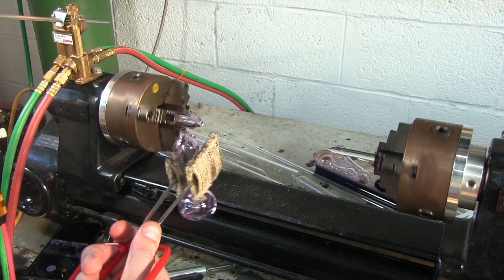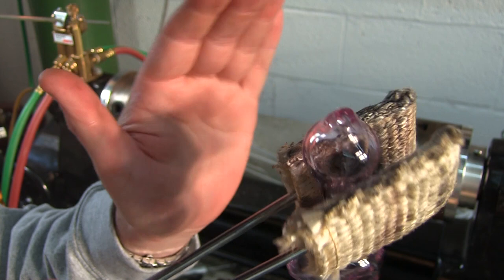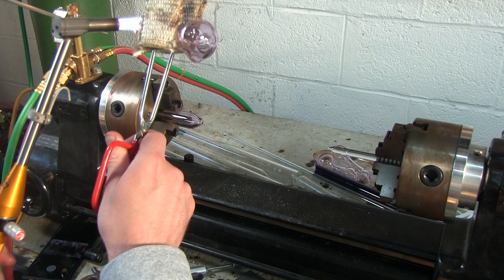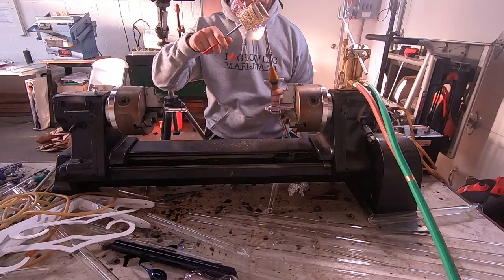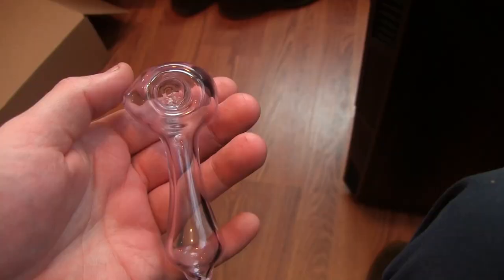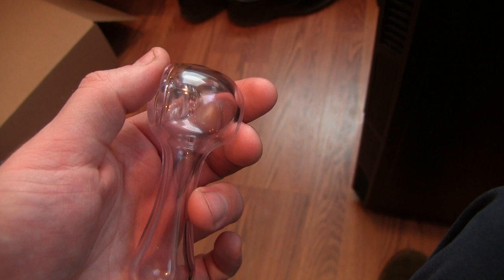What's great about doing this on the lathe is you have a nice small hole there for your mouth. You could just slide this tube down, close it down and start the process all over again — so this is easy for mass production. You can just continue to make spoon after spoon all off that same piece of tubing and rinse and repeat. Flame polish that in so it's nice and smooth — no one's going to get a cut lip on that. And that's going to go into the kiln to anneal. Here is the finished pipe — I got a video of it after it was done annealing. Don't forget to like, comment and subscribe. I might send this pipe out to someone who comments. I'll see you guys in the next video.